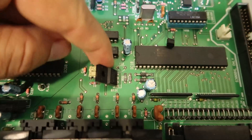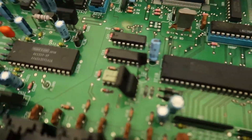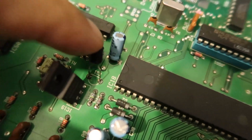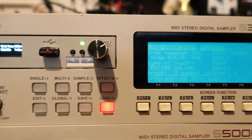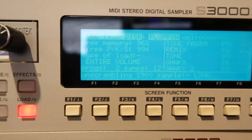Here's the culprit — this is the N25K IC circuit protector. I've chopped the legs off and I'm going to just re-solder this onto that. Hopefully it'll work. Okay guys, that's done. I just soldered it and blobbed it in there — it's holding, looks good. Right, all done. That is now loading up fine, as you can see — all my samples are loading from my HXC.